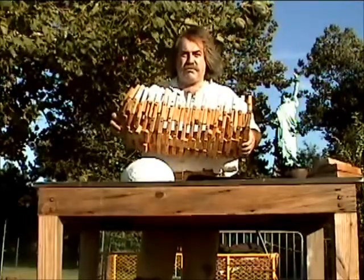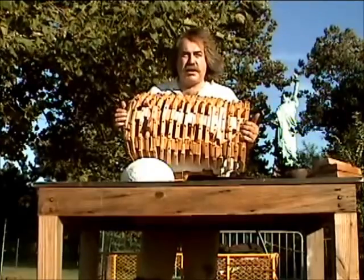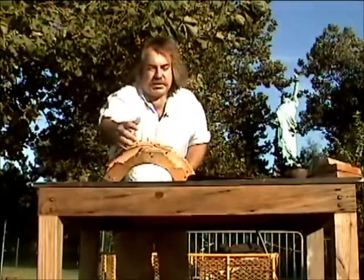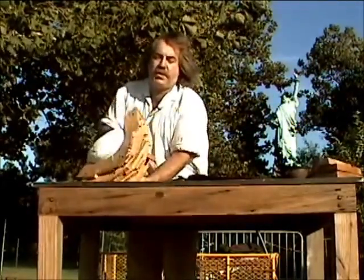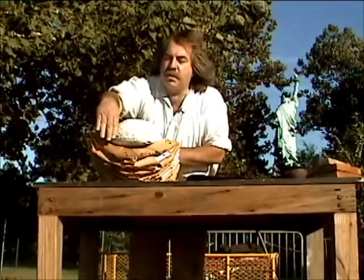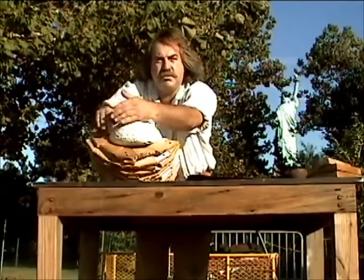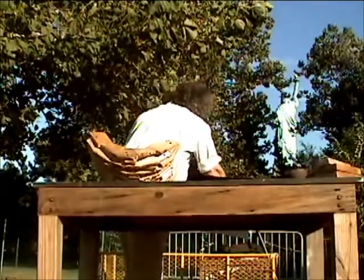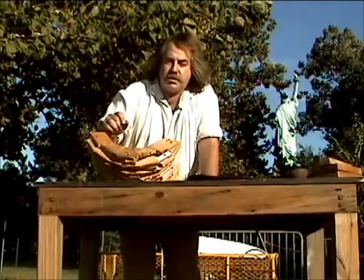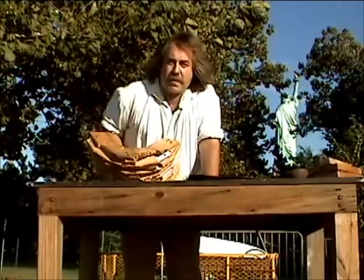9 hours to make. Where you see screws here, they would have put pegs in. Wooden pegs. Wet wooden pegs that would dry and expand into the spots. Now the reason that it takes so long is simply this. You start out with your mold, the finger, in this instance. You put a piece of wood here. Then you put a piece of wood here to mark that point. You mark this one, you cut it, and then you bind it to this one. So I can't make this piece until I make this piece. And therefore I can't make this piece until I make this piece. And all the way across and all the way back.